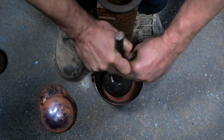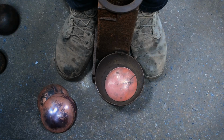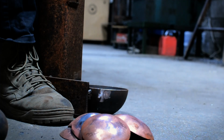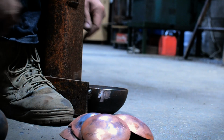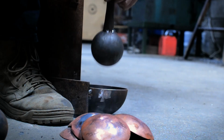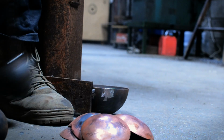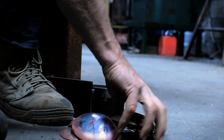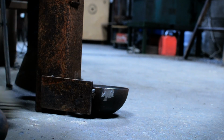I think I remember we didn't even have any copper discs. We had to cut and grind a piece of copper sheet and quickly work out the tooling. In the film, you'll see some quite rustic tooling. It's stuff that we welded together, made quickly to get this one product so we could photograph it. But actually, we're really enjoying the results from that. We've kept the same tooling, because it gives a particular type of texture.